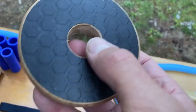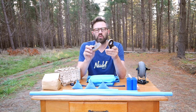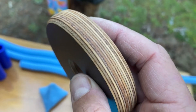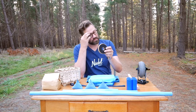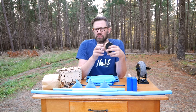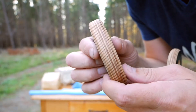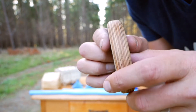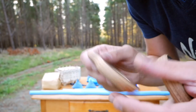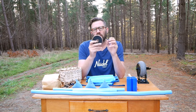The surface is a phenolic surface which is naturally antibacterial. There's 18mm plywood and 12mm plywood, and the 18mm plywood is very fine grain detail — it is 13 layers of northern European birch. That birch is very slow growing, beautiful timber, fine grain, very robust but not heavy. You'll notice there's no voids or gaps in the plywood so that water can't get in. It's very high quality furniture grade plywood, not too dense, so it's got a nice flex to it but it's still very strong.